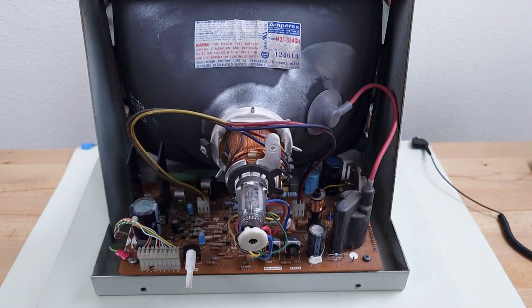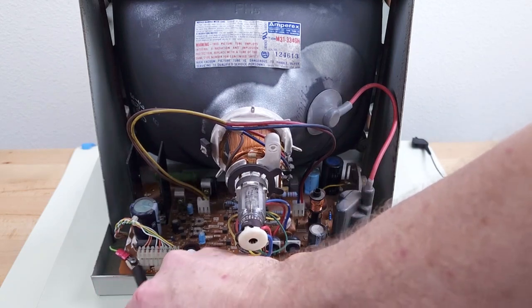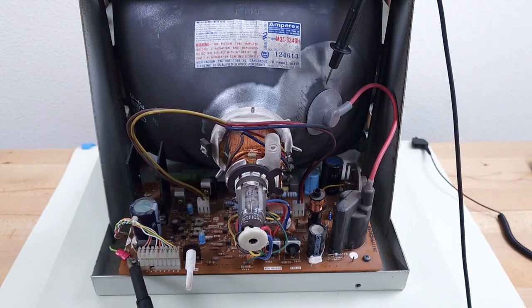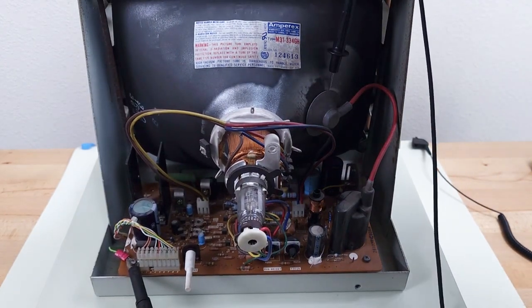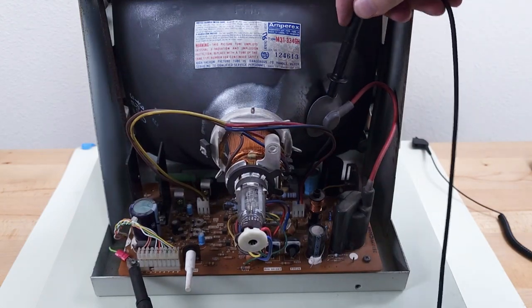The height is good now. The brightness is not all the way up — that's all the way up. Take it down a little bit, still be visible. So I'm not going to adjust the sub-brightness any further. The board looks good, it's definitely working. We need to discharge that CRT again, so I'm going to connect the ground. Make sure that's a solid connection. That scares the crap out of me every time, because the arc jumps way before I get in contact with it.